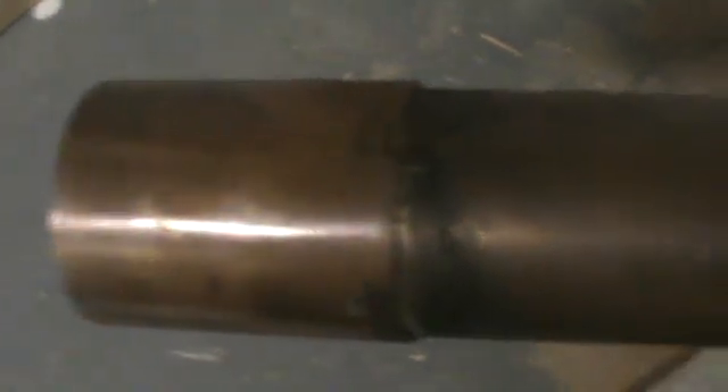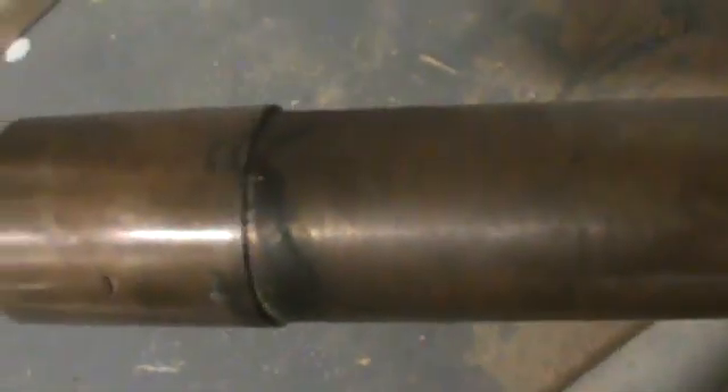I mentioned before about the copper sheeting. Here I've cut the fingers — let me get some light down there. There you go. You can see the fingers, and I soldered that to the inside of this two-inch copper coupling, which got soldered onto the copper pipe. That's what's going to grab the loading coil as it moves in and out of the lower mast section.